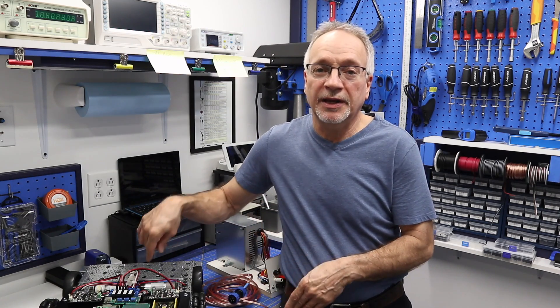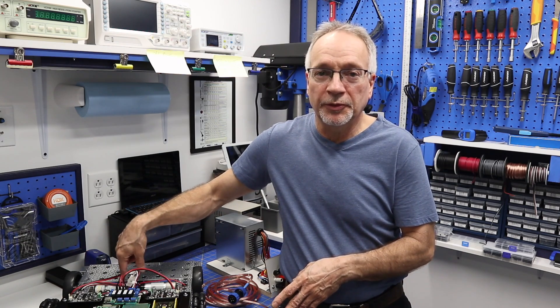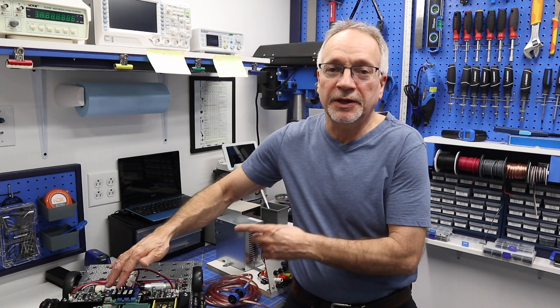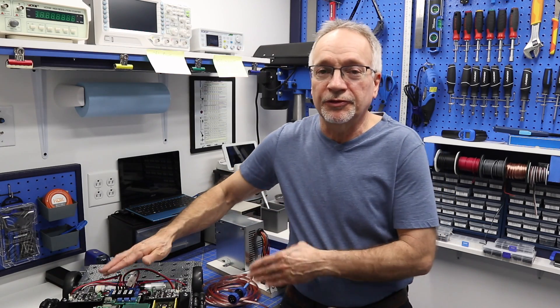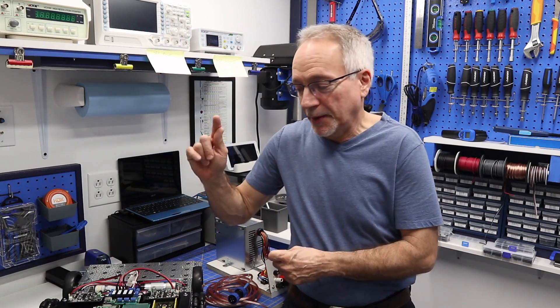It also became quite evident that it's very important to test your wiring. I said that at the end of the last video, and when I went through the testing myself, I found I had a wiring error. I actually had crossed one of the wires on the front terminal strip, thus shorting out the five volts and the ground. So it could have been pretty catastrophic had I powered it up with the power supply. Of course, I've got fuses in the power supply — they would have just blown — but it's an important thing to always test your wiring.